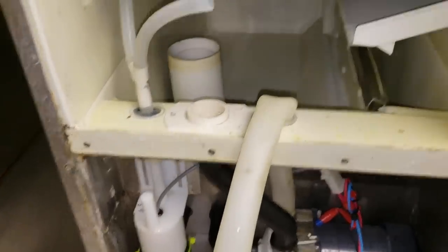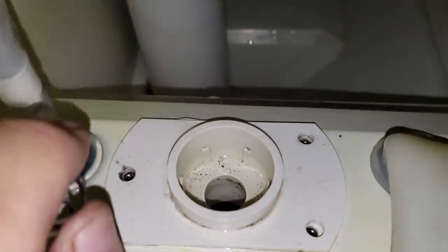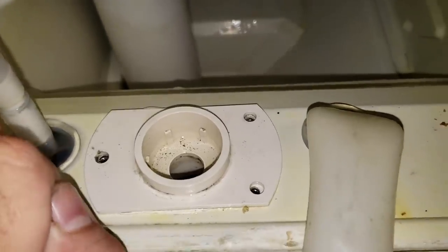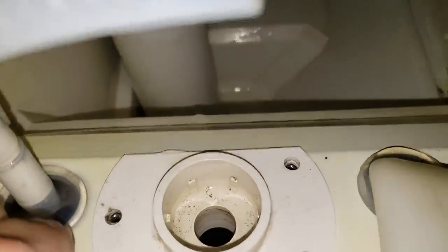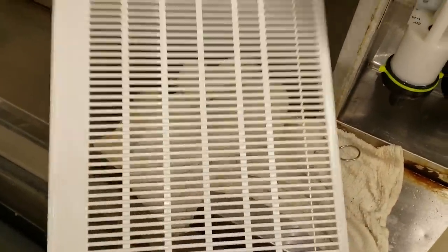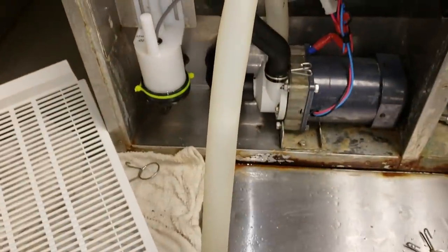When working on these machines, this is your check valve or pump-out spring. I'm going to pull this off and look inside — see that sediment? That's your worst enemy. It causes the pump-out spring to get stuck open and the machine will run out of water early and do a premature harvest. That's not the problem we're into right now, but since I had it open and drained, I was checking it.